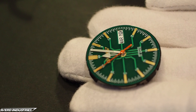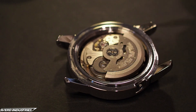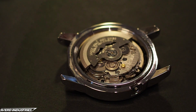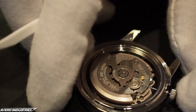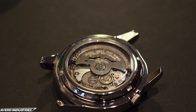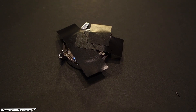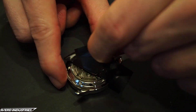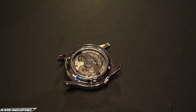Now it was just a matter of placing all the parts into the watch body. I placed the case over the watch movement, pressed it down, and checked that the rotor could spin freely. Once confirmed, I inserted the crown, which also helps keep the dial in its proper position and prevents the movement from shifting inside the watch case. The case back was screwed down as tight as I could by hand, before covering the backside with electrical tape to protect against scratches. Then I used my case back remover to further tighten the case and once again checked the rotor could spin freely on the inside.